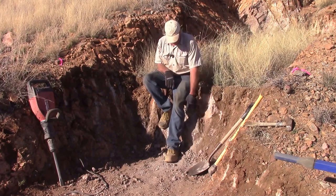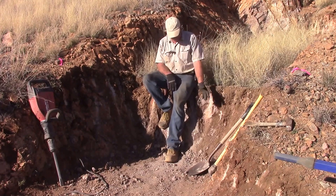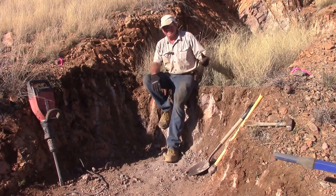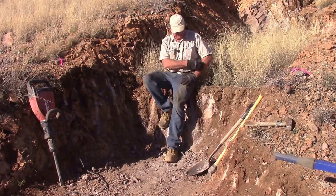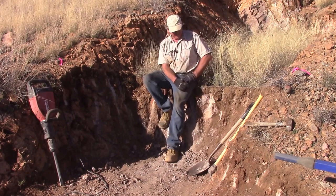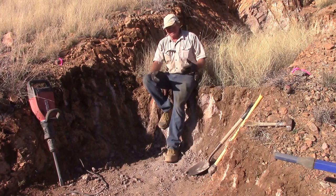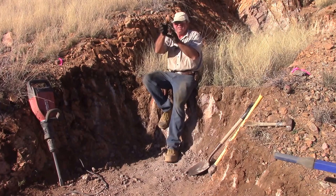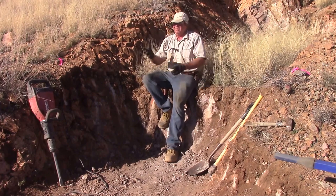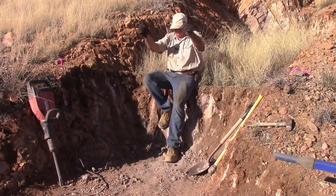When you do, the toe, which is the bottom of the face here, is going to tend to rise on you, because by the time you get down there with a hammer, there's a big pile of rock and you can't really get it down to grade. So once you've peeled everything off, then you rake it with the mattock, haul the big stuff and throw it over the edge. Then I dig the mixed stuff and the fine stuff and dump it right on the top edge. If you've got a mixed wheelbarrow, you dump it so the edge of the wheelbarrow is about that far back from the actual edge. That way anything bigger than this rolls down the slope. And do it quick. Foomf.